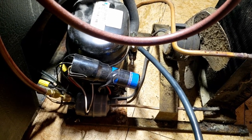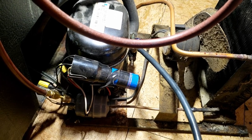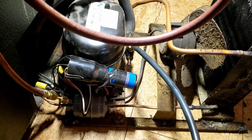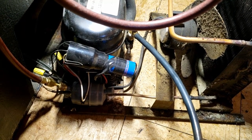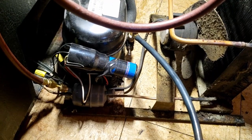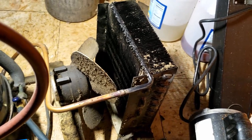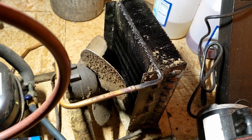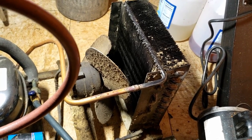I still have to pull back through the valves — tried different directions to get whatever I can. The filter dryer is way bigger than the original one, so I'm probably going to have to add about two to three ounces for that factor. The charge is 11 ounces. I cleaned off some of the crud off the cutting side of the blade — nowhere near as good as I'd like — but until we see this thing run I'm not going to waste more time on it.